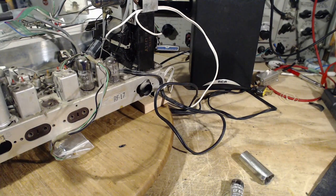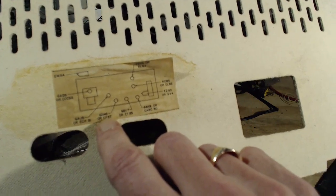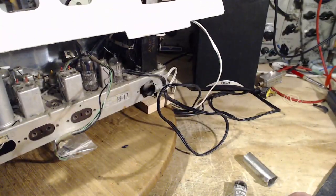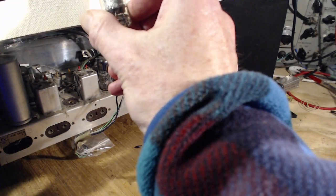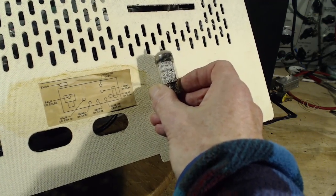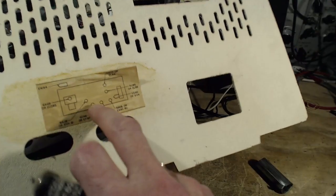And the little diagram is on the back here by any chance? Yes, there's one here too. EF87. 6DA6 or EF87. That's this tube. That's this tube. 87. EF89. You know, you never know. You just never know what is going to happen here. Whoops, sorry, I've got this all held wrong. So EF89 sitting where an EF87 should be. That just doesn't sound good to me offhand. Huh. I mean, this is right on the back of the radio itself. This isn't something I fetched off the internet.